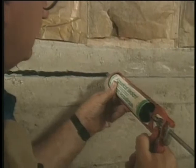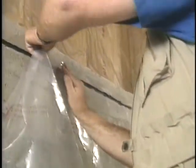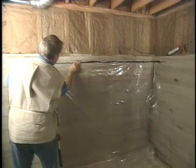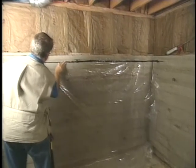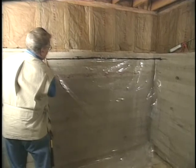The acoustic sealant will receive the polyethylene. As the polyethylene comes up into place it adheres to the acoustic sealant and they're compatible — they are made for one another for this particular purpose, and also to seal moisture out.